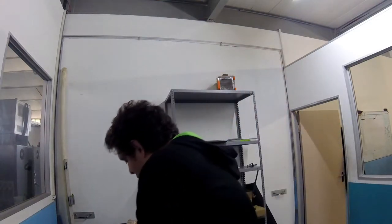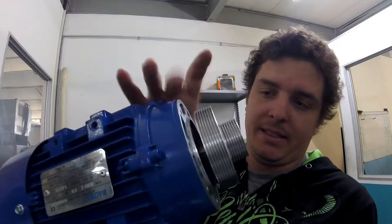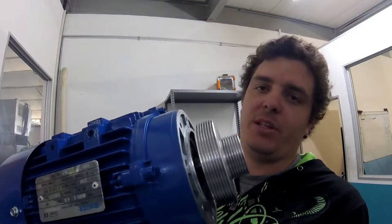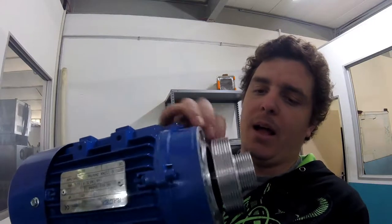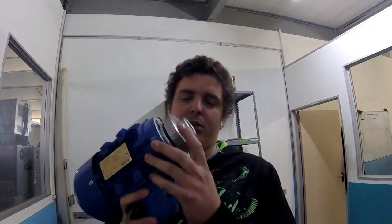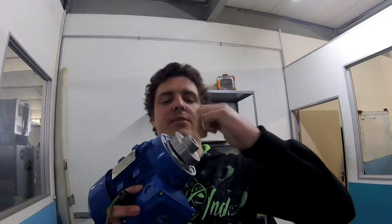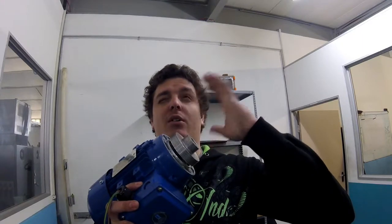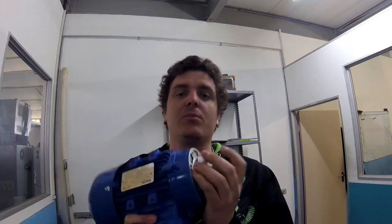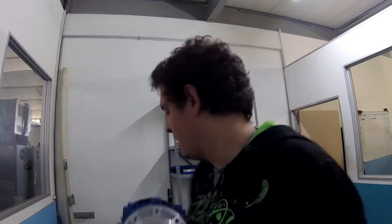Then got one of the pulleys made. Little motor. That is a J-section pulley, 7 grooves. I ordered my material a little bit short, so instead of 40mm long pulleys, I got 36mm long pulleys out of it. So seven ribs instead of 8. That should still transfer more than enough torque. Then why cut that out? Because I was lazy. So that's done.